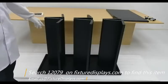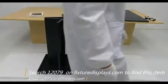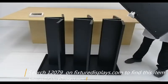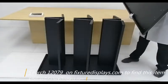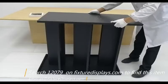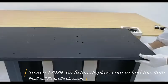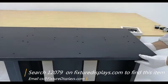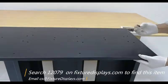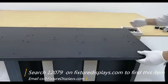Now we have all the sub-assemblies on one side panel. All we need to do is install the other side panel. Make sure the side panel orientation is correct — the welded nuts face the same direction as the other side panel, and the inside of the side panel faces inward. Align all the hole positions and fasten with a screw and a nut.